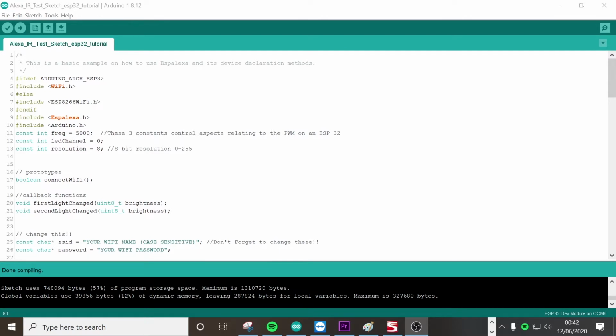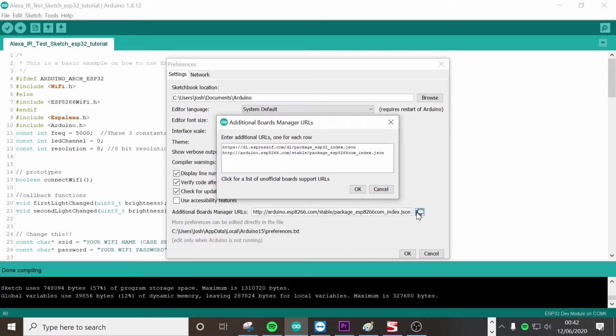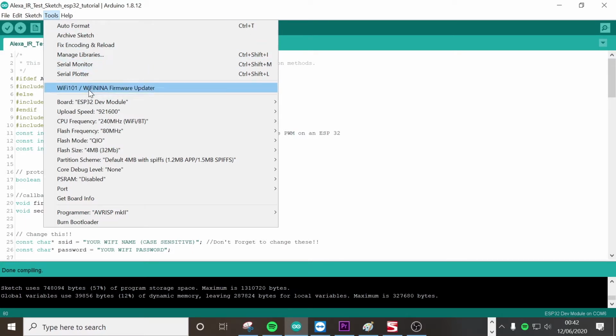Next, we are going to be uploading the code to the ESP32, so plug it into your computer with the USB cable. We're going to be using Arduino. If you don't know anything about Arduino, that is fine, although you might want to watch a couple of basic tutorials on YouTube, just so you know roughly what's going on. You will need to go into File, Preferences, Additional Boards Manager URLs, and then you'll need to copy and paste the appropriate URLs for the ESP32 and 8266 if you are using that. This can be found in the description below.